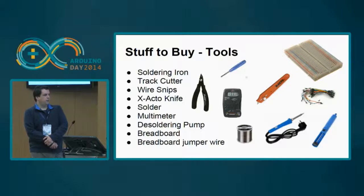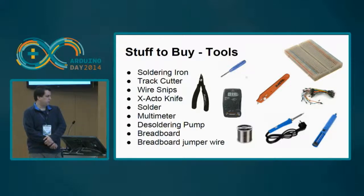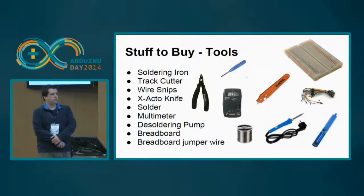And then, as an advice, before assembling the circuit, you should try it in a breadboard. The breadboard is not a definitive solution, but it's a nice one if you want to test a new thing that you don't know if it will work, and it's easier to change.